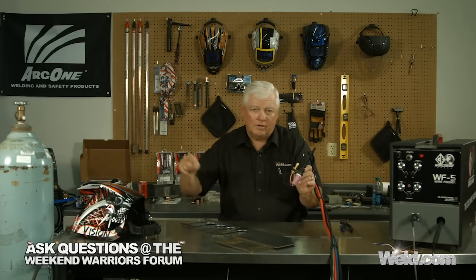I've tested it a little bit, so I'm going to put my gear on in a few minutes and do an actual live run. When you're setting this up for steel — that's what I've got today — I've got .030 diameter, it's just MIG wire. MIG wire is TIG wire. We're using argon gas; all the settings are like you would do manually — argon at 15 CFH. The trick is I can do long runs. It's just a fatigue factor — how long can you hang onto this button and weld? But it does make it a lot easier.